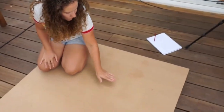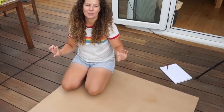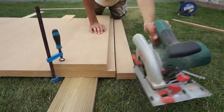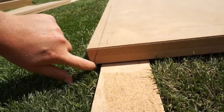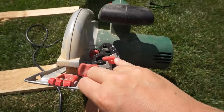Finally there are four pieces that are 9cm wide — left the full length of the wood — and these will form struts under the top of the table and also under the bottom shelf. We've now got all our support struts, top, and shelves cut. Now we're moving on to the side legs which are still attached to the board, and we're going to cut the five degree angle pieces first on either side. Our circular saw allows for changing the angle of the blade, so we're going to cut these with the circular saw now.